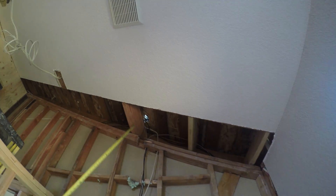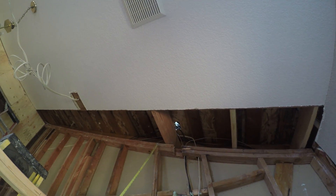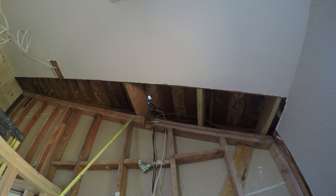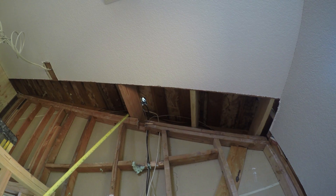We put in the block and we're going to have a metal clip — clip the top plate to the block. The block nails to the rafter so the force can transfer to the roof member.